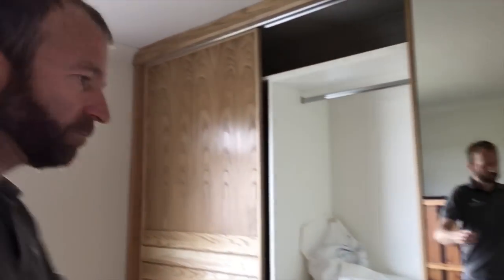The upstairs door was essentially a 12 millimetre board with a solid frame of the same proportions. Although I had reservations about building these doors this way, I thought they'd been built that way upstairs and were okay. But when these started to show signs of bowing after fitting, I went and looked at the upstairs door again — and it is bowed too.